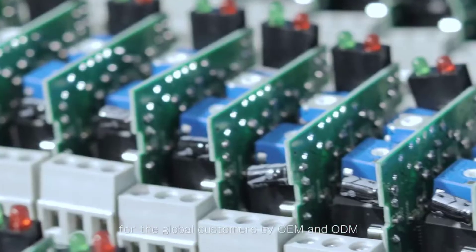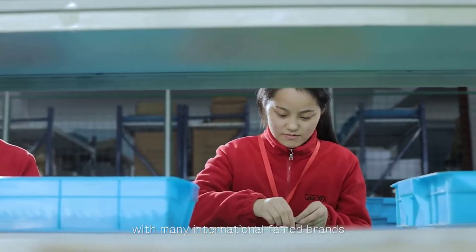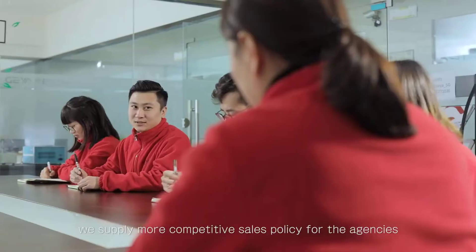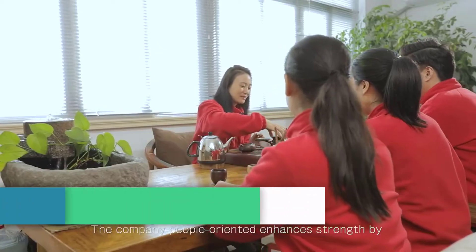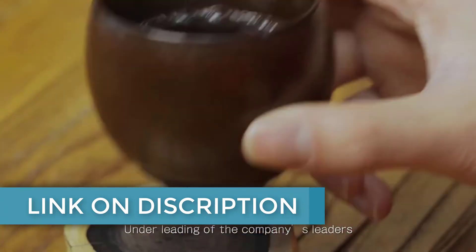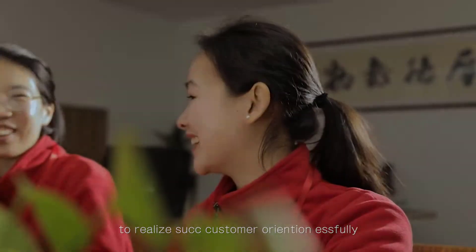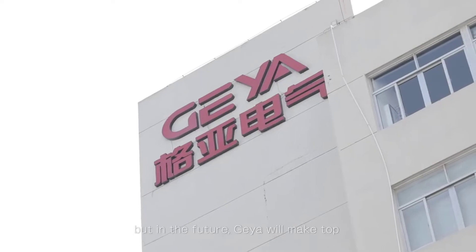Product Parameters: 1. Model Number: STVP932. 2. Power Supply: 3-Phase 4 Wires, 230V/400V AC, 50/60 Hz. 3. Max Loading Power: 50A / 63A / 80A. 4. Overvoltage Protection Value Range: 221V–300V Adjustable, Default 280V. Overvoltage Recovery Value Range: 220V–299V, Default 250V. Overvoltage Protection Action Time: 0.1–10 seconds, Default 0.2 seconds.